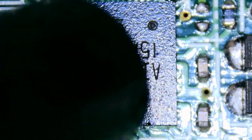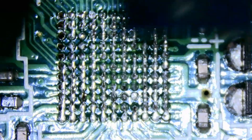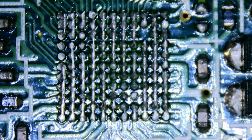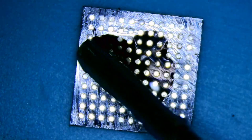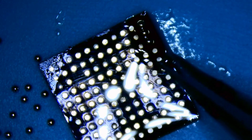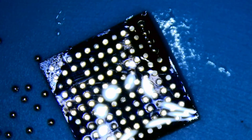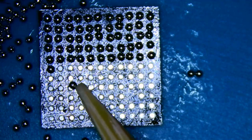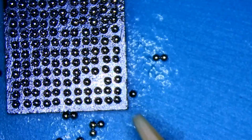Given that capacitor did bugger all for me, I'm removing the chip now off the donor board. We're going to try and re-ball this chip. Keep in mind, I've never re-balled a chip in my life before, so this could be a disaster. There are 121 balls on this chip. I'm starting at a 0.45 millimeter ball size — I don't know if that's right. Those balls started touching way too much, so I've abandoned that one. We've done it again — 121 balls at 0.4 millimeter ball size.